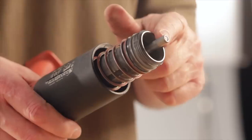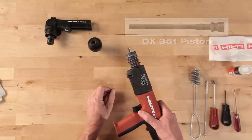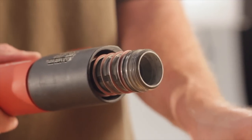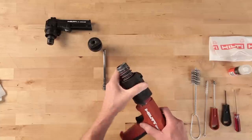To remove the piston, rotate the black housing collar on the tool body counterclockwise one full turn and stop. Remove the piston from the piston guide sleeve. After removing the piston, unscrew the black housing collar completely from the tool body until free of the threads.